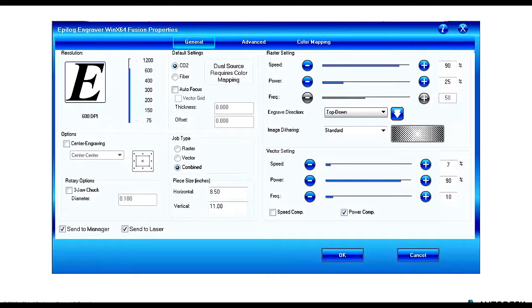And once we've identified what material we want to be printing on or cutting, there will be parameters that we need to put in here. If we have different types of wood, we'd need to play around with these parameters. If we were doing acrylic, that's another type of material, so we'd have to be conscious of what these settings are. Now, the good thing is most manufacturers have figured this out for us already. And in our case, being down in the build space, we were able to collaborate with a lot of the people down there that gave us these recommended values.